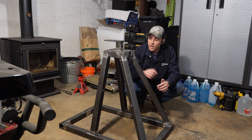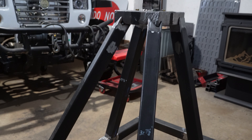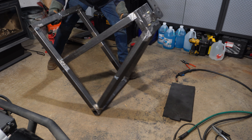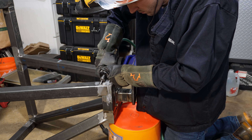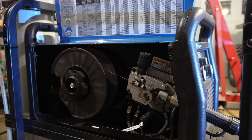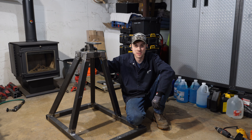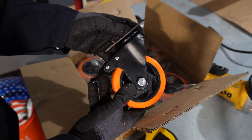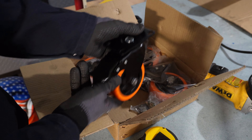The stand is tacked together, all the gaps look very good, and I'm very happy with it. I'll double-check all the dimensions and make sure everything is square before burning it all in. Once fully welded, it's a beefy frame. Since this is a hydraulic tube bender it doesn't need to be bolted to the floor — we can use casters. I got four casters and I'll make mounts on the bottom of the frame so the whole thing rolls around.